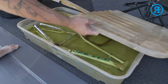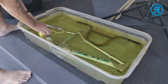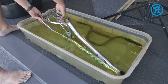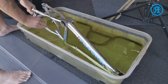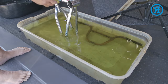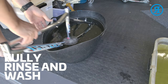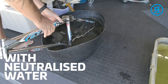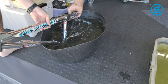So the frame's been in the bath now for 48 hours — that'll do it. It's time to grab it out, give it a wipe down and show you how good it looks. We'll transfer it over to the washing bath. I really want to make sure that I get this water all the way through all the insides of the tubes so that we can neutralize the acidity inside and out.